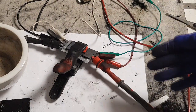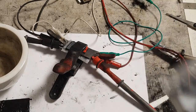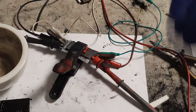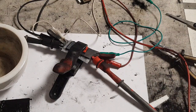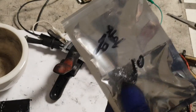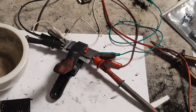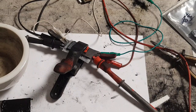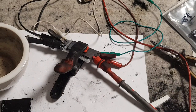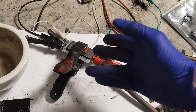In this design, on the negative electrode I added a little bit of silicon - I crushed it to make a powder and added a little bit of carbon black. The weight of silicon I used was 0.03 grams, which is a really tiny amount. And I got 25 minutes of runtime at 30 milliamps load, compared to only 10 minutes with carbon-to-carbon electrodes.